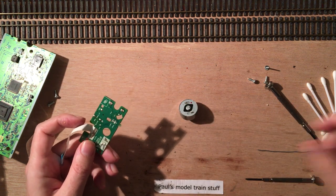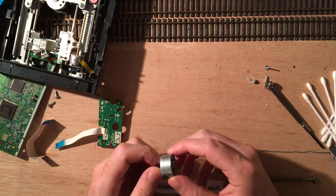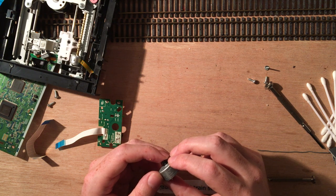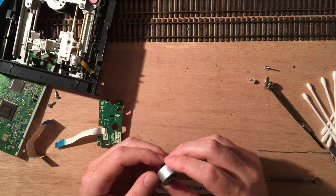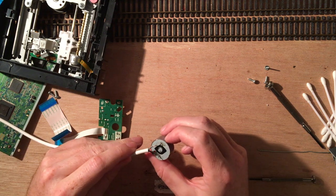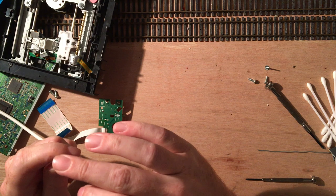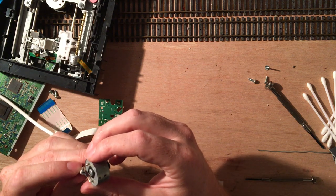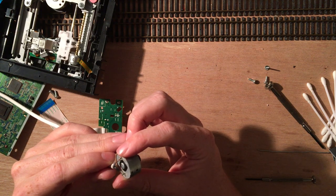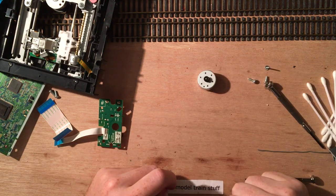And there we go — this is what you're looking for. All of these have different voltages. Sometimes there's something written on them giving you a model identification. Here it says 'made in China' with some model number, but no voltage, although this may say 5.9. I've got a Fleischmann transformer here, so I can put some power on it — and it spins. If I connect the leads I can feel it spinning. It's not going very fast — this is full power. I think this one may be in a good range; I have to measure it out or look it up. That's how you get a motor out of a CD drive.